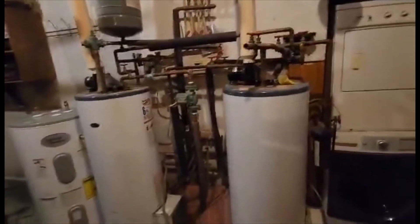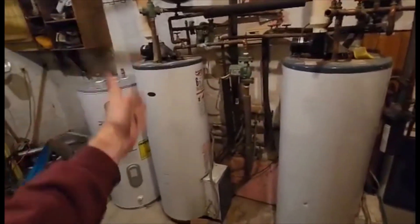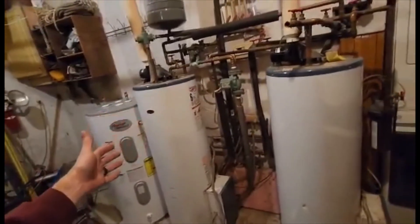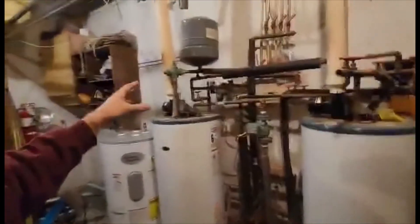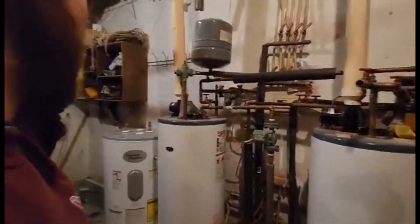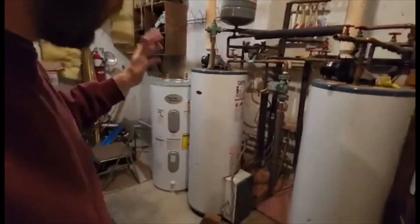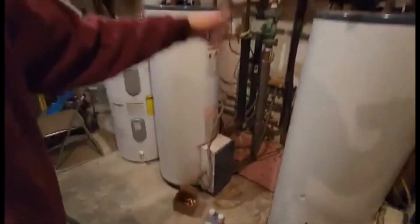Those improvements will make a big difference this winter. Here's our heating system basically. We have a propane water heater and I ran the system to heat the house originally 20 years ago off of just that - it wasn't cheap, but it worked. It just circulates the water through the floor upstairs, through the concrete, heats it up, and back through again - pretty simple system.